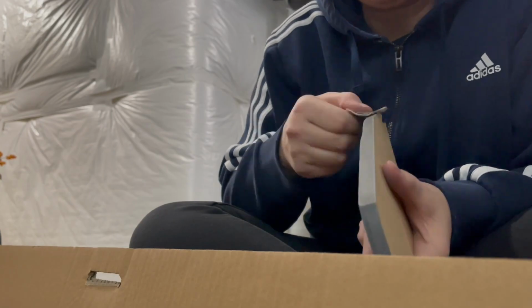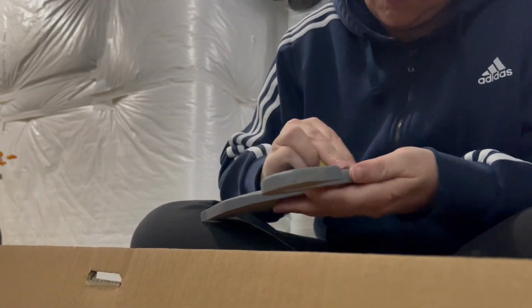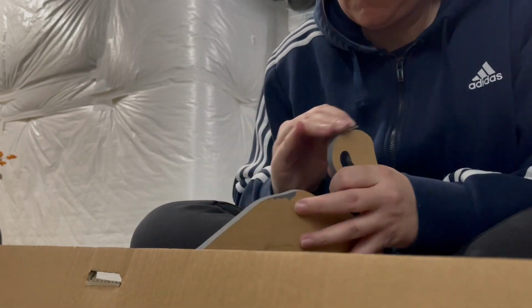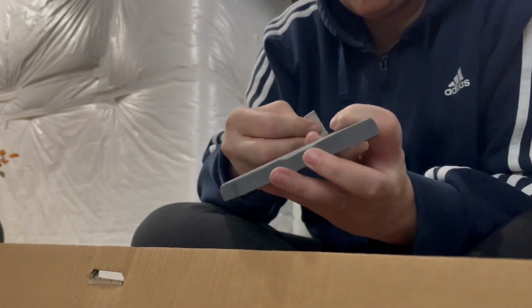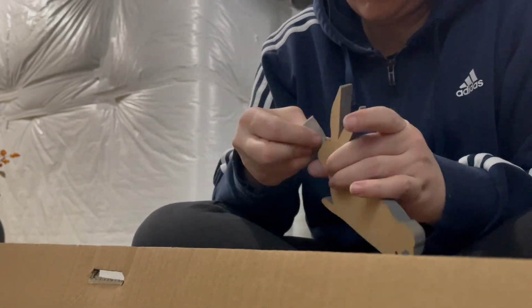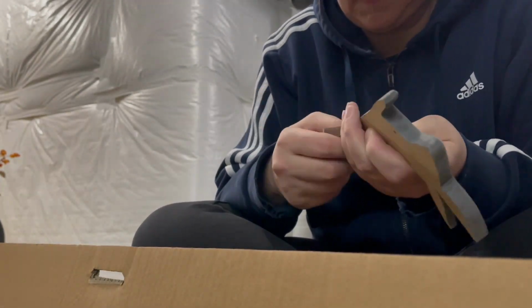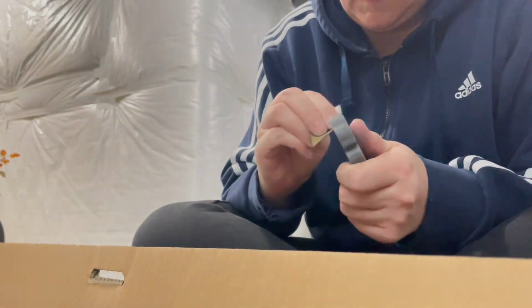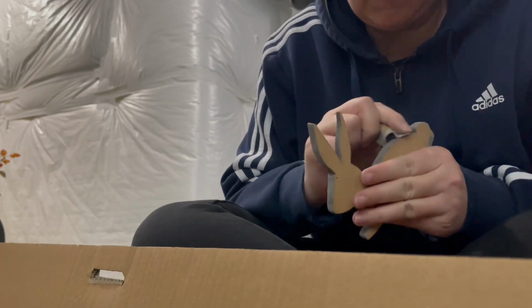It gums up no matter how long you wait. I waited overnight, it was more than 8 hours, okay? And it was still gumming up on my sandpaper, but whatever, it's fine. It worked, it's okay. So I go through and I just really sand it smooth with some 220 grit sandpaper. And this is so that whenever I put that final primer on there, everything just looks really smooth. There's no MDF showing, so the paint won't go on super funky.